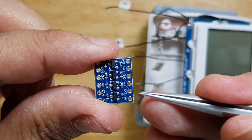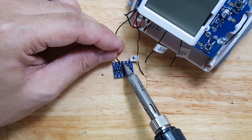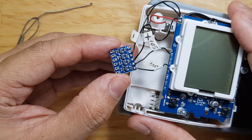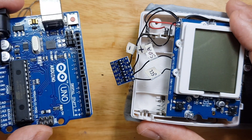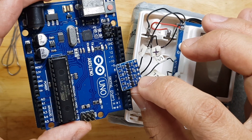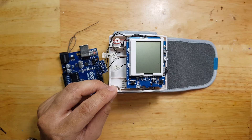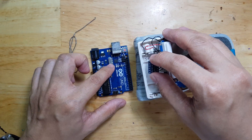We will just use one pair here, so LV1 and LV2 for our application. I'm now done soldering the wires on the respective pins of the logic level shifter. Now it's time to use our Arduino for the 5-volt side. We just need to connect the LV to the 3.3 volts so that there will be a 3.3-volt supply on this blood pressure monitor sensor device. I'll just stick it here using tape, then I can solder the wires from the Arduino board.